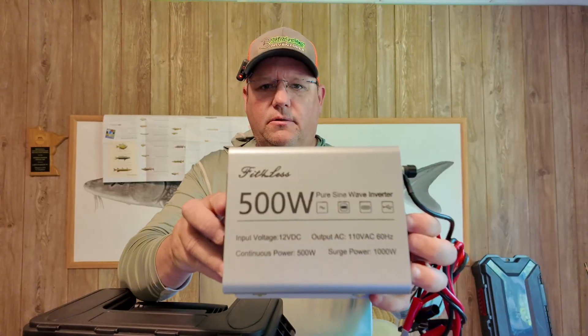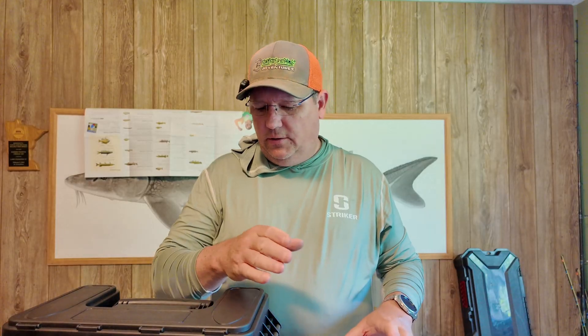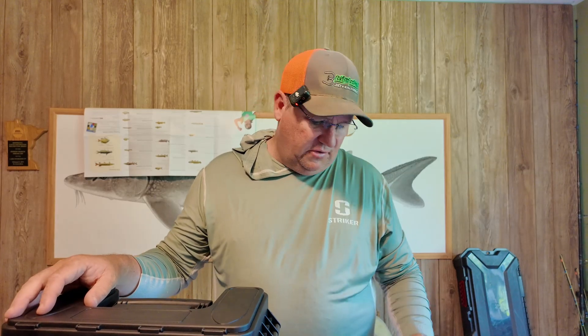The other reason I was interested in this battery — not just the small form factor, but the 100 amp hours at 12 volts makes it great for emergency use. I picked up this pure sine inverter — this one is 500 watts. With a 500 watt inverter you can run a surprisingly large number of appliances. Small fridges, freezers, toasters, blenders — and for power outages: routers, modems, laptops, TVs, fans.